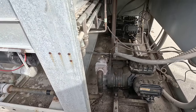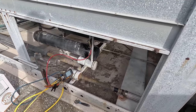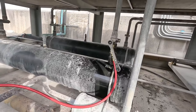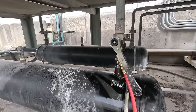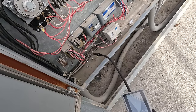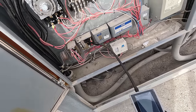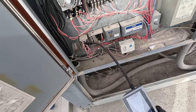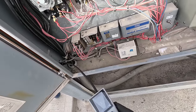It's kind of interesting that they're cycling the fan in the middle - that's probably jacked up. It really should be the closest fan to the manifold on the end. With the leaks that we had and the sight glass leaking like a sieve, we're going to start searching for leaks now that we've got around 200 pounds of pressure - we should be able to find any leaks on the discharge side. There's tubing all over the place in here and we're going to scan all these diaphragms.